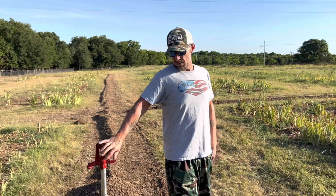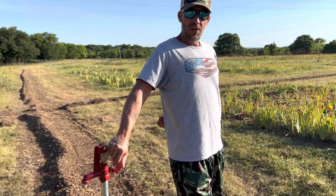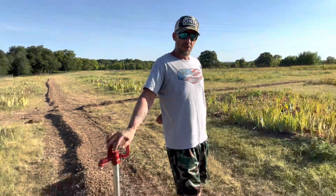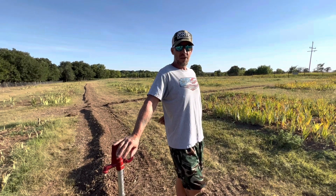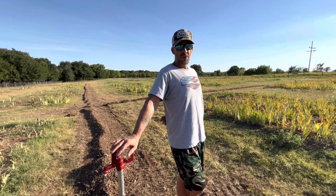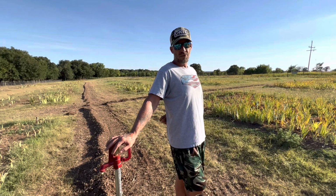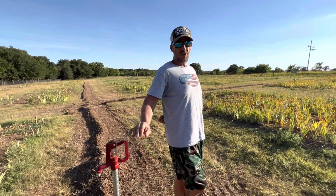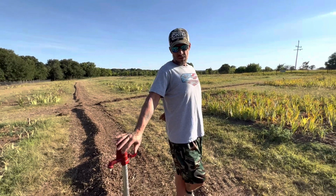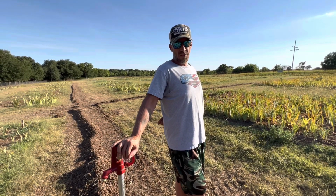And then on my faucets, I got pea gravel. You put pea gravel at the bottom of your faucets, that way if they can't drain through the dirt, they're pointless. So you have to put pea gravel or something at the bottom to let the water drain once you shut off the valve. It's got a hole at the bottom to drain the water. You always got to make sure to do that, otherwise you're defeating the purpose of putting in a frost-free faucet.